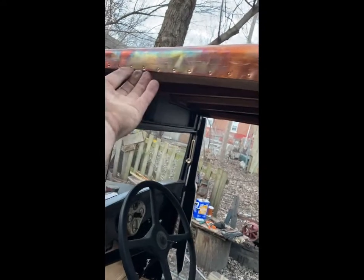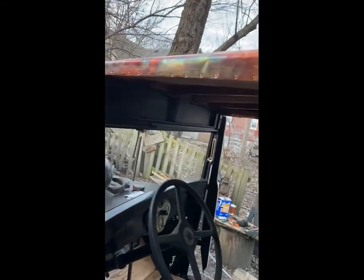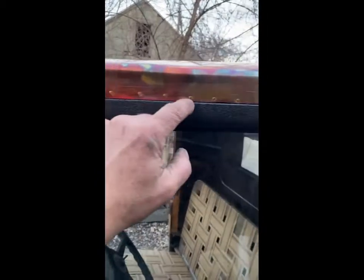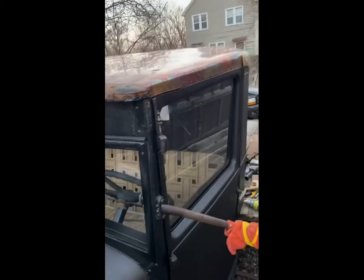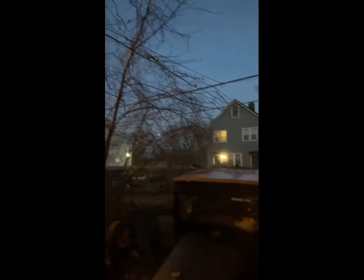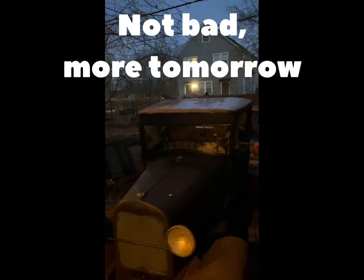Here's our front so far. I've been drilling these out and using a body hammer — I can sink them in nice and flat with a little dish to the head, and there are no hammer marks in the copper. That's rough enough as it is. I'll go ahead and get the other side. I could trim that and tack it all in. I could hand file some of this hanging down and give it a nice edge — you could compare it to the door. It'll tell every little flaw, but I like it.